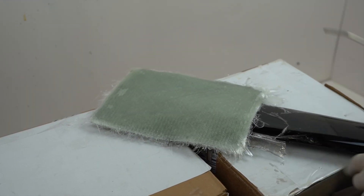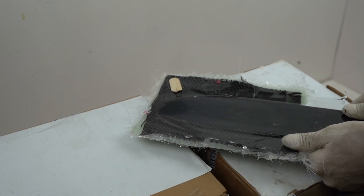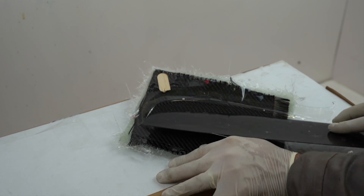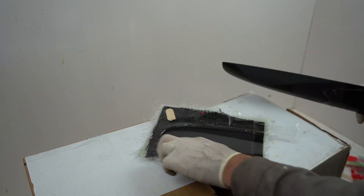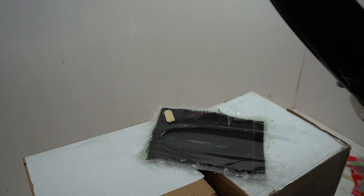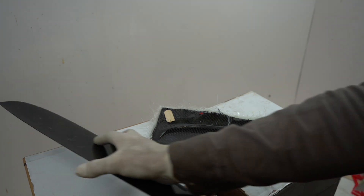See the mold release stuff there — oh no, it did go around a little there, but this side maybe not. Look at there — still good. That's what you want. You want to get the mold around the parting line. That parting line on a propeller is hard to do because it's curved — it's not just on a plane. You can't just set it level and go there. That's pretty easy when you have a symmetrical part.